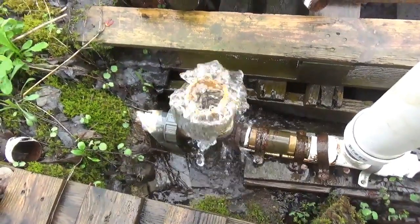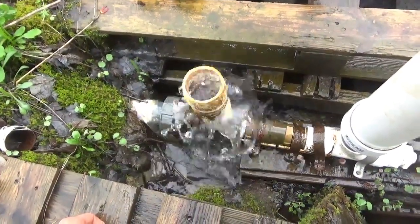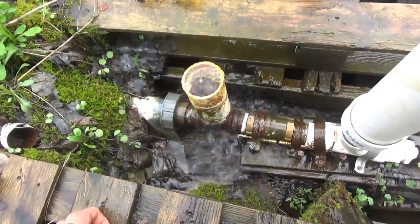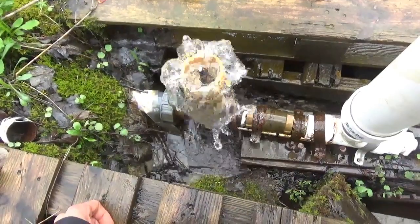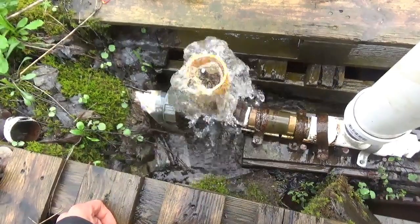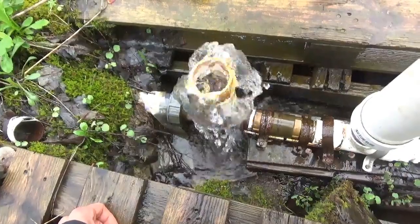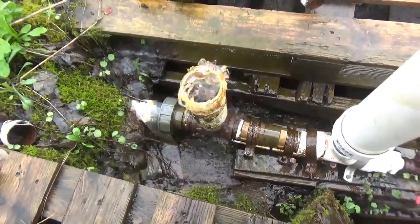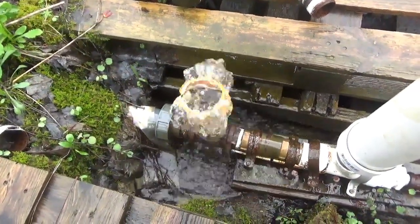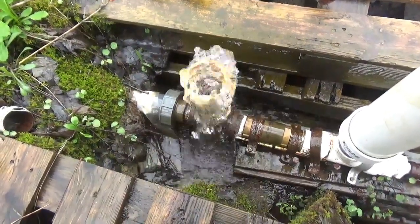That's better. Notice how much quieter that is — how much less pounding action you hear in there. We'll go back up to the standpipe and listen. You'll hear that that pipe isn't whacking so hard now too. That valve might be a little bit loose — you can hear it float in different landing positions. That's alright. We're gonna upgrade this valving system at some point, maybe this summer if we get the time to build a better valve.